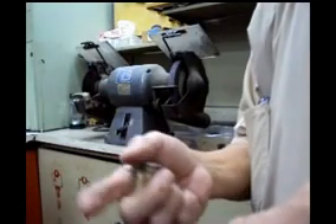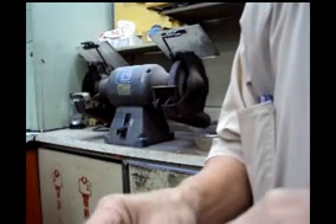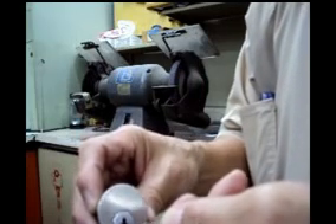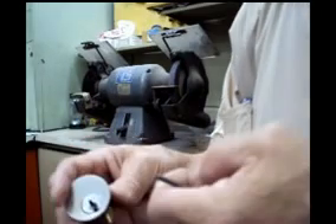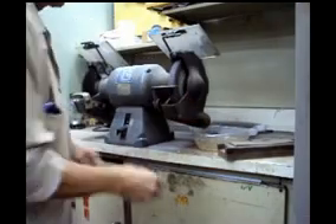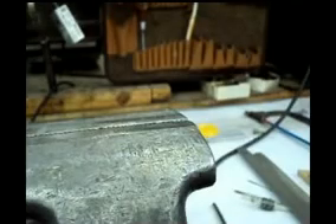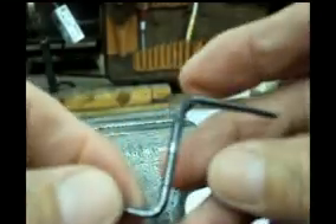The second step is to make this side here flat and thin, both sides, in order to penetrate this cylinder bottom here. This key opening here — it should go inside, it should be inserted there. So I'll grind it now. After you have grinded it from this side, you can grind it well. However, from the inside, the grinder cannot cut up to this point here. So what you should do is better trim it with a hand file.